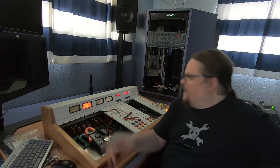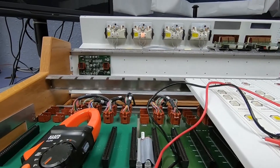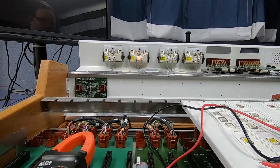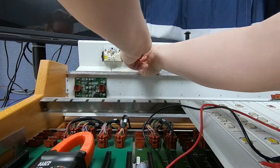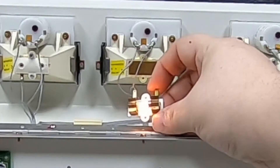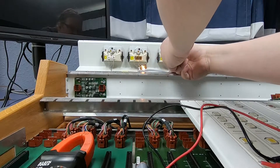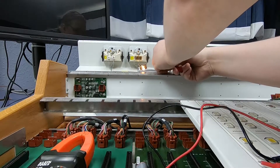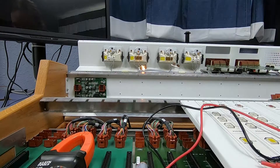I don't think it is. And I bet these are incandescents, given the age of this — white LEDs weren't really a thing. So let's pop these open and see what we got. Maybe we can do an LED conversion on these. Here are the VU meters. Let's pop open the working one first and see what we've got. That there is an incandescent bulb. Given that it's incandescent, it could be AC or DC. I'm hoping it's DC, because it'll look nicer if I do an LED on it. The side of the meters say 6 volts, 1 watt. So I'm guessing that's what these are. Let's see: 5.3 volts — not quite 6, but it's definitely DC.